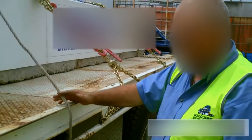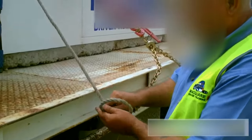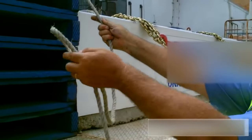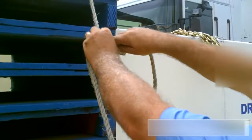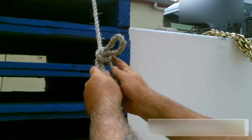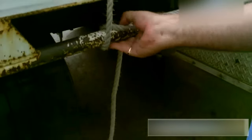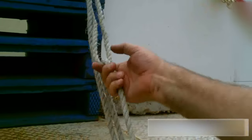The other knot, probably simpler and more efficient, is the basic truckie's hitch or the beehive. Same again — make a loop at combing rail height. The right hand goes up on the rope in a natural grip, take the loop above the right hand. The right hand wraps around once and the second time it wraps in behind it. With both hands pull that tight and that will tension. The left hand comes down into the loop, bring the rope through the rail and through the bottom loop. Pull the rope tight, pulling down not out. Put the leg out in case the knot gives way.